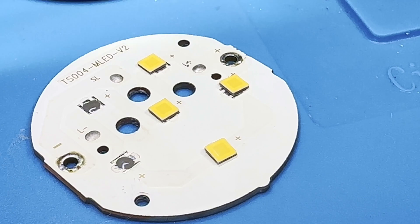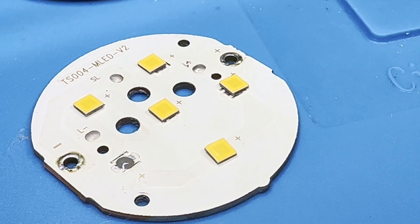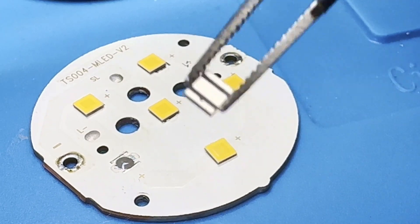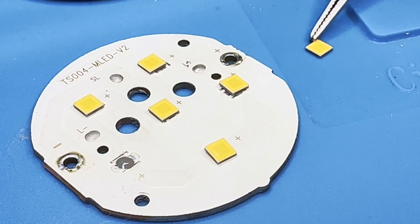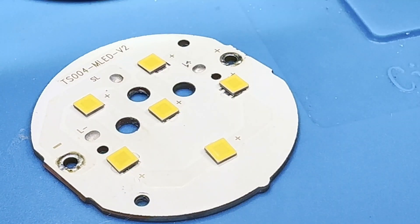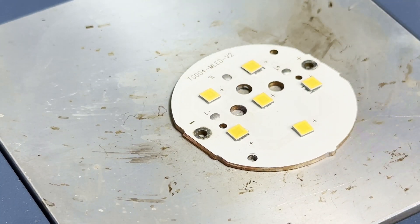I've cleaned up the board, put a little SMD chip flux on there, and I'm setting these Fireflies 351A emitters on in the correct polarity — negatives on one side, positive on the other. All these polarity tips are covered in the other modding video I linked to. The next shot will be these melting into place — my favorite shot. Setting it down carefully on the hot plate and watching those things melt and center by themselves. I love that so much! See that top one just bounce in.